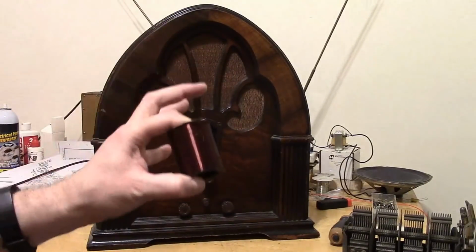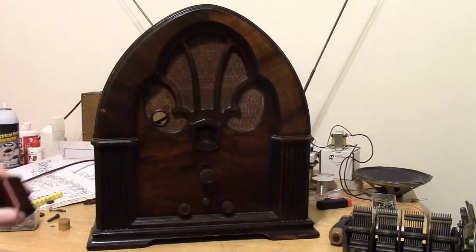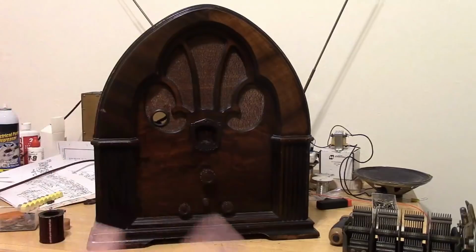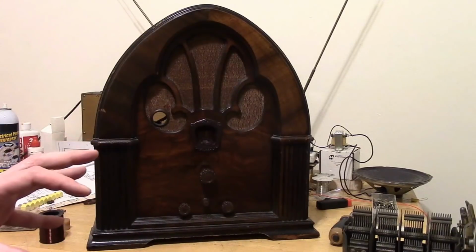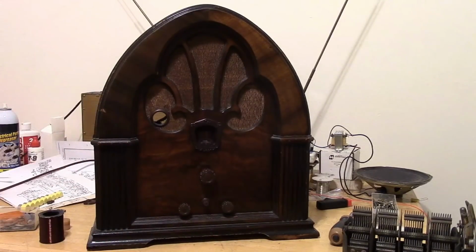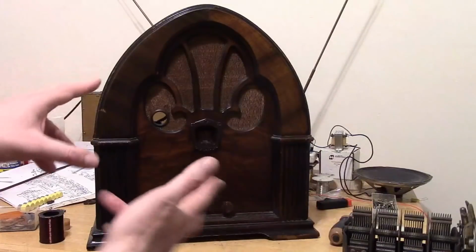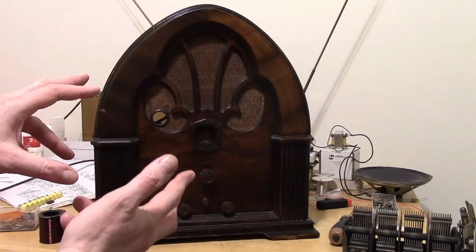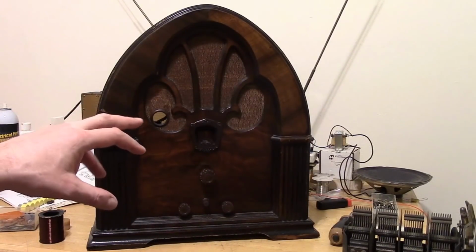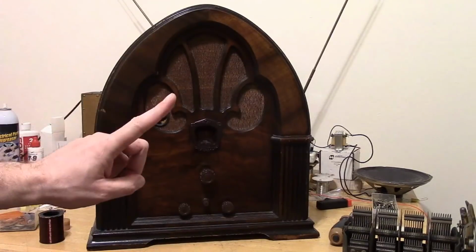We've got an open field coil to patch up, a paper cone speaker to stiffen up and patch up, and we have to rig up some kind of output transformer and put it all back together. Well, so there'll be one more installment, and hey, then we get to compare the sound quality of this rigged up Philco 20 speaker and the speaker that would have come with this radio originally. So stay tuned, one more installment to go.